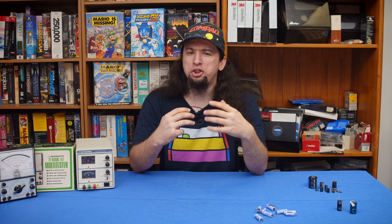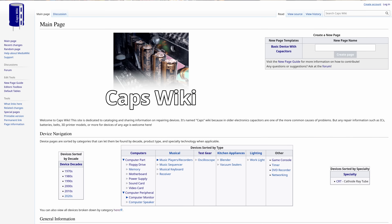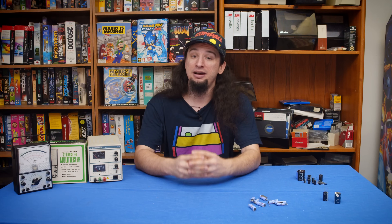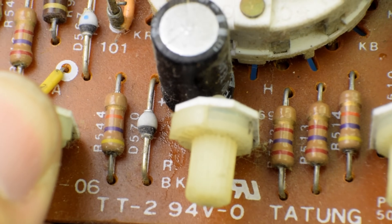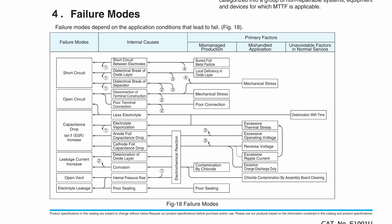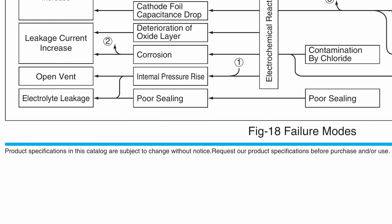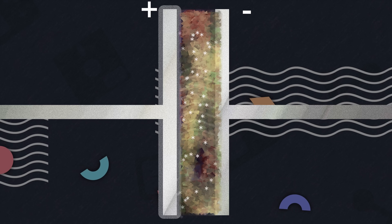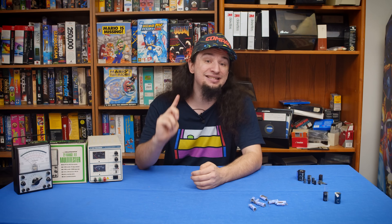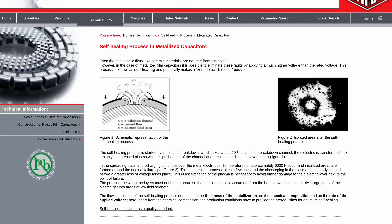But this isn't the end of the process. Electrolytic capacitors don't last forever — there's a reason I built a whole website specifically for cataloging capacitors and devices so you can replace them more easily. It's well understood that capacitors commonly fail by drying out, bulging, or leaking, but these are anomalous problems. When everything works correctly, capacitors should be able to operate until they run out of electrolyte. During normal operation, the electrolyte itself is consumed by the capacitor because the oxide slowly deteriorates over time, which would reduce the breakdown voltage — except that the oxide is continuously rebuilt by a chemical process that depletes the electrolyte. This is known as self-healing and is a normal process as capacitors are in use.